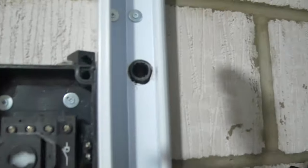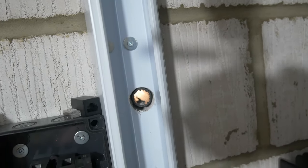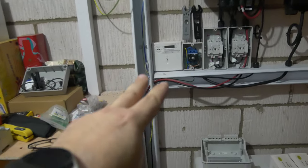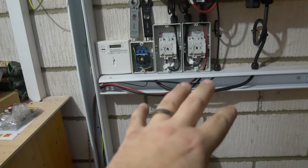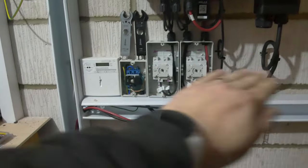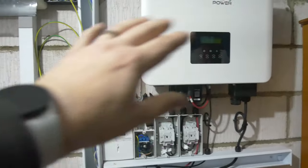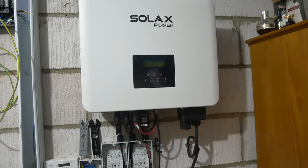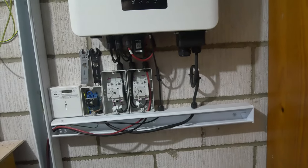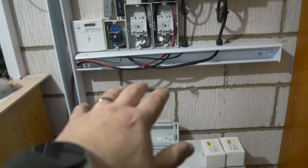For the strings, we've got our duct through to outside — we've ducted through the cavity, inside to out. It's on a downwards trajectory so any water that could ever get in is going to go out, and we'll seal up inside and outside. The strings are going to run down the trunking, drop into the SPD enclosure. We've got our DC isolators which will cut off the power from the solar panels, so anybody coming along to replace anything will face no DC energy from the solar panels, and with the two AC isolator switches isolated there'll be no AC either — a safe system.